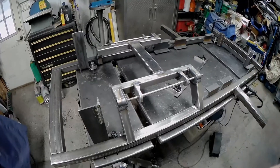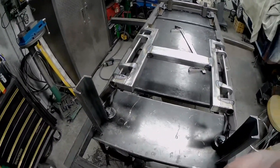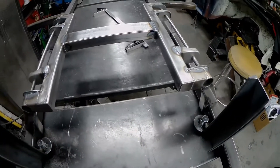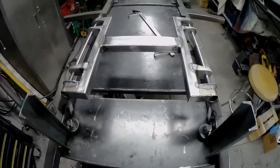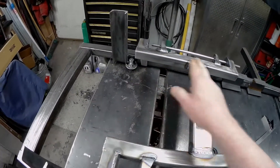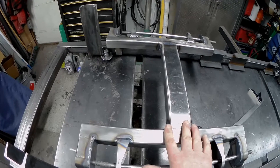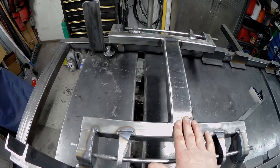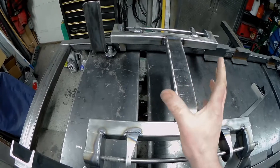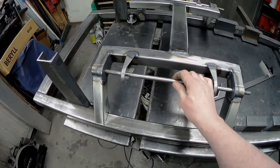The welding is finished. It didn't turn out too bad — I'm happy enough with that. The welds look good. As you saw in the stop motion footage, I did have to put a scissor jack on each side and pull these things a little bit back into dimension. You've got to plan which way you go about welding all of this — how you're inducing heat and where the contractions are going to take place. I'm going to give myself a pretty good mark on that one — it's mostly good.